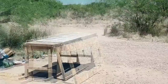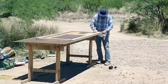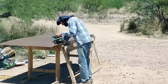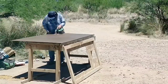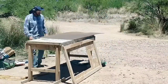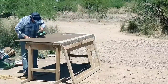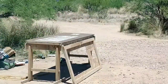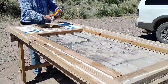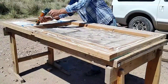The OSB sheeting will be on the inside of the door and for the outside sheeting we're going to be using a piece of hardboard. I'm bringing that over now and getting ready to cut it out. I was able to just lay the sheeting up on the table, put the door on top, and then trace out the outside size of the door as well as the window and pet door openings. Before putting on the outer sheeting I wanted to insulate the door as much as possible, so I filled up all the gaps with hard foam board. There wasn't much we could get in there, mostly at the base — the frame takes up a lot of the space — but we insulated it as best we could.